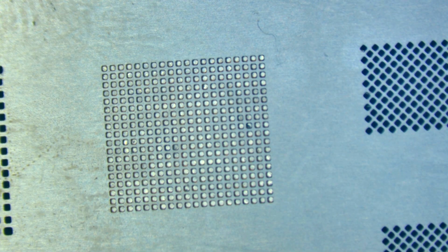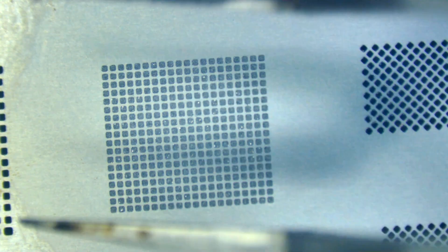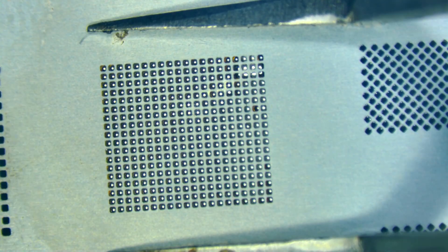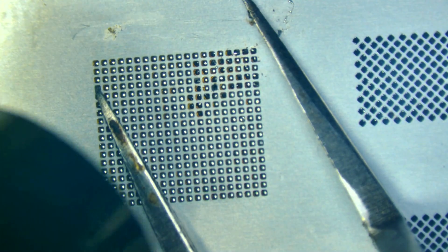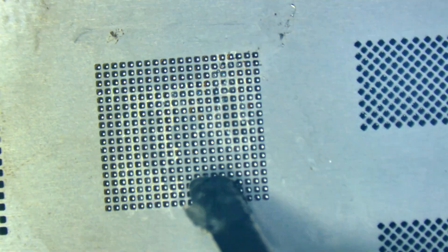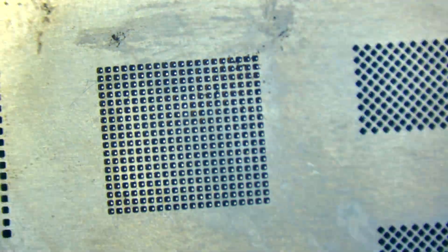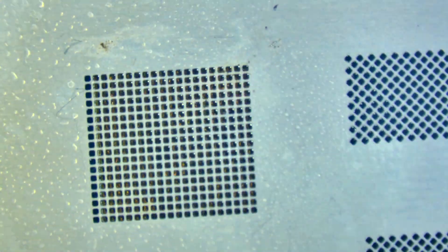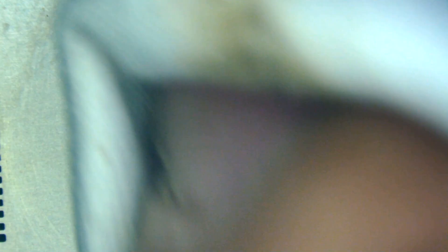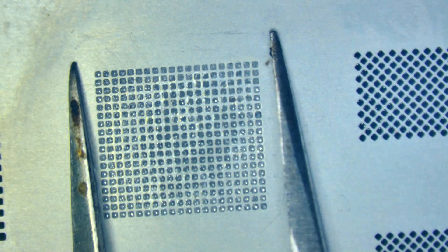Let's go over some common failures for those just getting started. Let me show you what can happen if you use solder paste without properly drying it out. When the solder paste isn't thoroughly dried and you go over it with hot air — given that the stencil does warp here and there — the solder will start to move around too much. It will slip under the stencil and combine with surrounding solder paste, causing the reball to not be uniform.